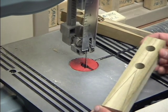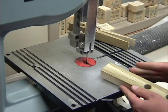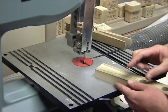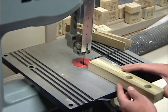I will show you this first time how to cut right on the pencil line. If you start getting off, don't try to correct it — stop, back up a little bit, and redirect your cut. Don't try to force the band saw to change its direction.